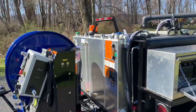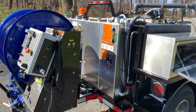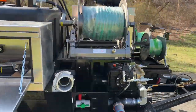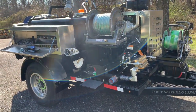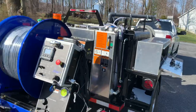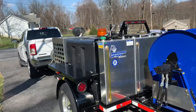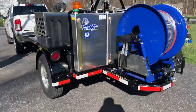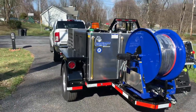As you can see, it also has three aluminum tanks. The far tank is your fuel, the center tank is your antifreeze, and the smaller near tank is your hydraulic fluid. Other options you can get with this jetter include an XL version, which is a twin axle, twin tank — so you can have 600 gallons instead of 300 gallons. Our tanks are black 300-gallon poly. No white tanks for us — black tanks don't let sunlight through, so you don't have to worry about algae growing inside your water tanks. Other options include a second toolbox, an arrow stick, and an LED floodlight that mounts right here — about four inches round and bright enough to light up a football field. Great for if you do a lot of night jetting.